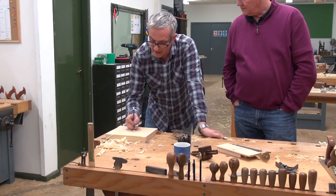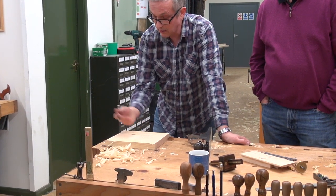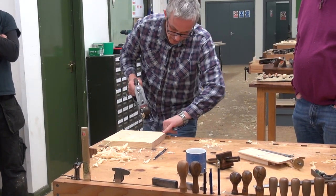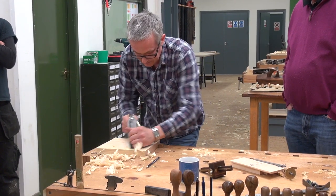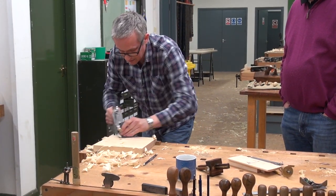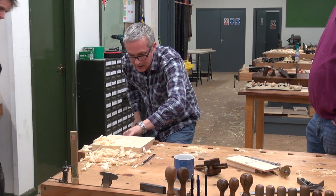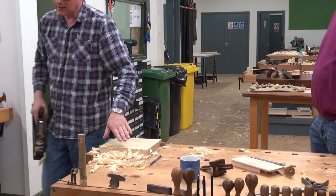When I get to here, that edge is going to get all feathery — watch out for that. Without having to look sideways, you'll see you're getting down to your line. When you get down to a given spot, stop planing from there, but continue where you're not yet down to the line. You can see it's just starting to feather up there. You can see it's just started to pick up on those edges as well — if your pencil line is fairly clear you should see a slightly darker line. I've got a line here, here and here, telling me I'm down to depth.